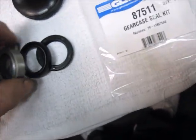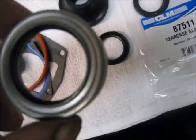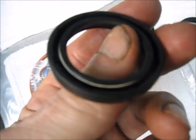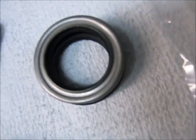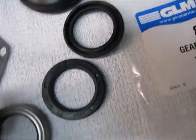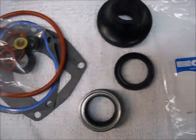There's one other thing - you only use two of these seals for the prop shaft. You could use them back to back, or you could use this one here: this side would be facing out to the prop, and the stainless steel spring side goes to the inside. Most people use this one - it's got an edge on it which is supposed to cut fishing line, but I can vouch that it doesn't work. I've seen all kinds of these chewed up with fishing line. The kit comes with two of this style, possibly so people have the option.